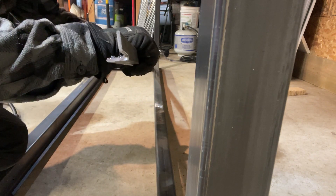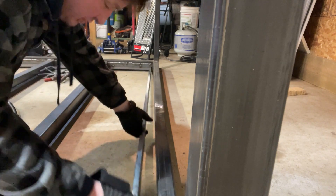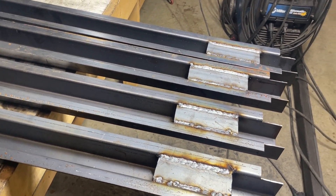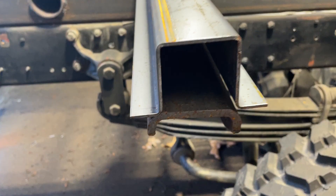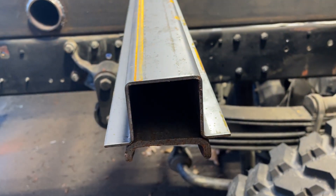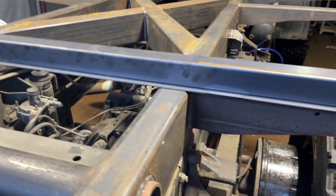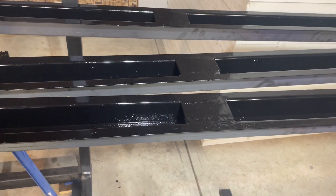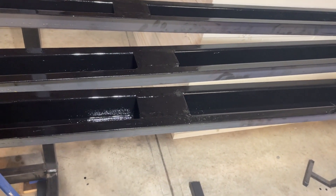This angle, one by one, is the last one which goes in here on the floor part. These are the four floor trusses which get mounted through the arms on the outside. On those four dedicated arms, I will have bolts going through the arm into the stiffener plate here on the ends on the outside — that's four times along the outside and five times along the subframe flange. Three here and two over there — they're painted already, and I had the attachment plates further in.